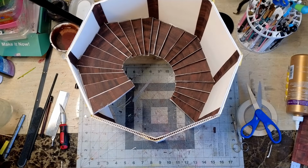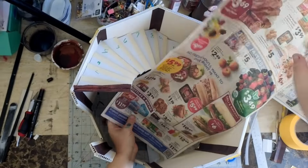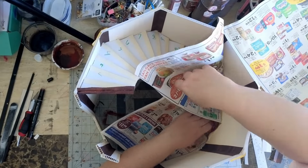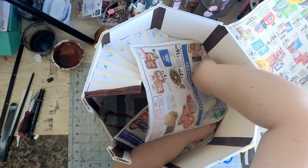Now that we've got the stairs made and the trim in, we need some scrap paper because we're going to figure out what shape we need to make for the cover on the underneath side of the stairs. Turn the tower upside down and then start laying the paper along the underneath side, making sure that you're touching the walls and the outside edge of the stairs. Use painter's tape to hold it together as you go.